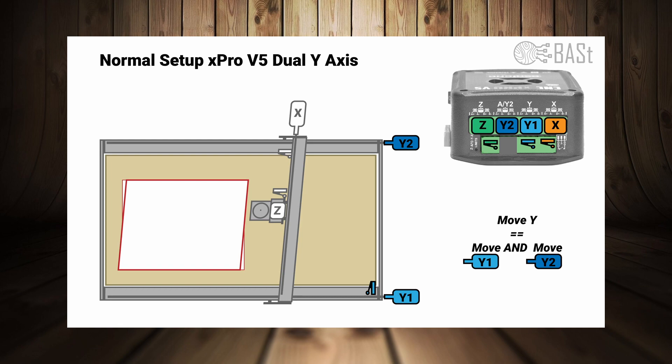And isn't that why we bought the CNC machine — to stop those errors from happening? But it's deeper than that: you also create tension in your frame, and tension in your frame creates extra friction, which leads to extra wear and even damage. If you have V-rollers you'll have to replace them earlier than expected, but with linear rails this becomes much harder and more expensive. Replacing a slider is a hassle, and if the wear is bad enough, you might even have to replace the entire rail.